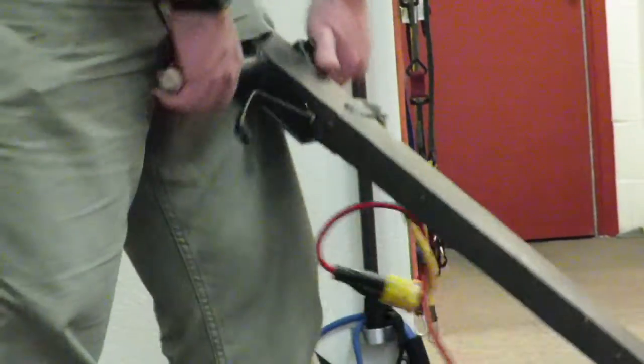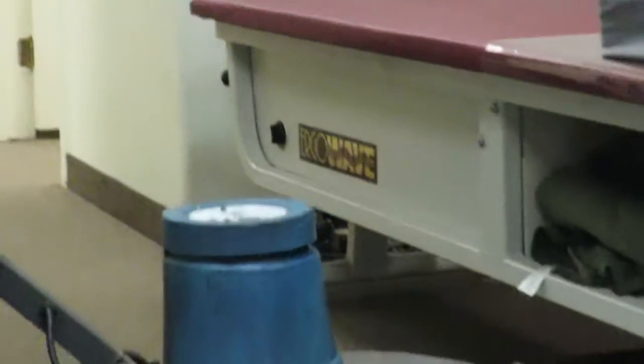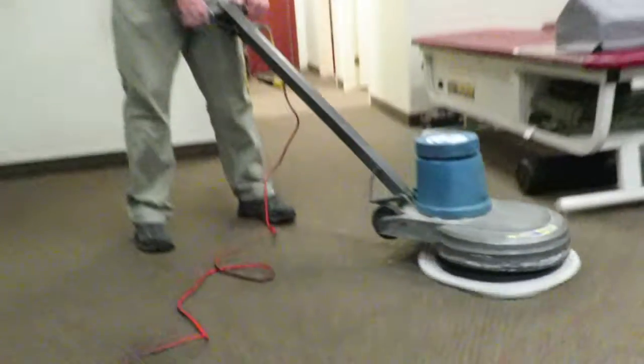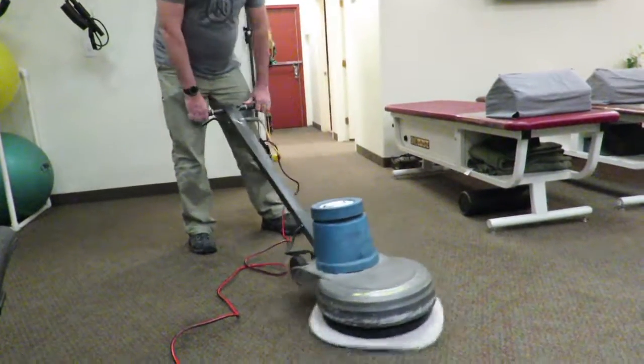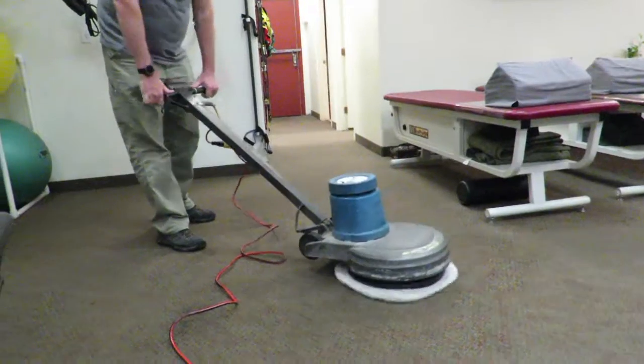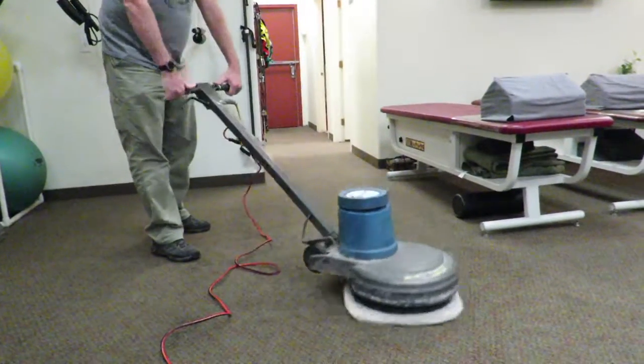Now, if you do it wrong, if you're relaxing too much, it's gonna do this. And that's dangerous. If you're lifting too high when you turn it on, same thing. Because when you raise the handles, it goes to the right. When you lower the handles, it goes to the left. So I'm not moving that around with my muscle. All I'm doing is pulling up and down on the handles. I'm just making that shoot around.